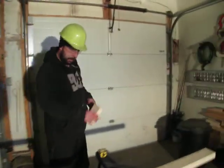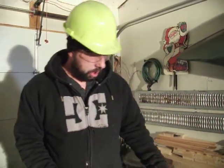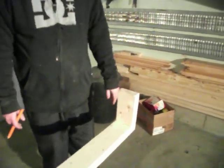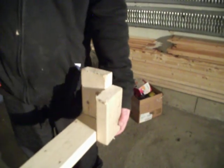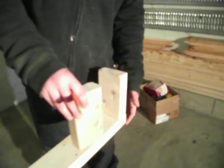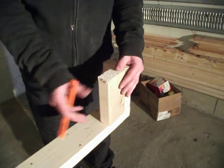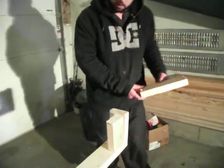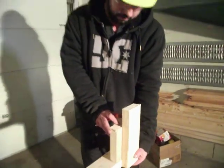There's one other thing you need to consider when laying out your wall plate — eventually you are going to have to attach this to another wall. If I have my end section laid out with just a stud here, when I butt another wall into it with an end plate on it, that limits the amount of nailing space you have to secure the two walls together. So instead, you install an L-stud. An L-stud is a stud that sits at an angle like an L, and when you come along with your next wall, you've got a much greater surface to attach the two walls, making for a more secure connection.